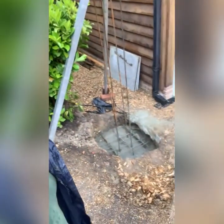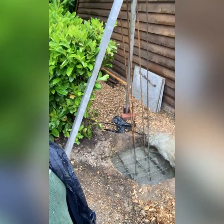So yeah, for now, apart from getting wet, there's not a lot more we can do. Leon's just knocking up the last little bit. Almost there now. We want 150 below finished ground level, because we want 2 course of brick in the ground, and then we're going to build up the piers. But we'll start the brickwork tomorrow. Hopefully the weather's better than today. It's a little bit hit and miss this week, but yeah, we just want to get cracking on now.